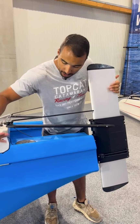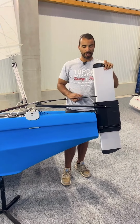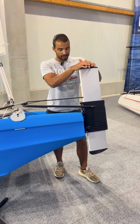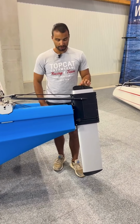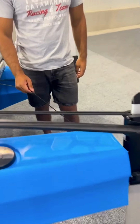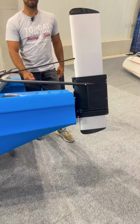I've propped up the boat now. If you have a slipway trolley, you can very easily and thoroughly inspect everything. First, press the rudder system down. The rudder system locks in place. The rudder case is then securely closed. The rubber is tight around the edges. Then we pull our line here, ensuring everything is set correctly. And as you can clearly see, the rudder system comes up wonderfully again.